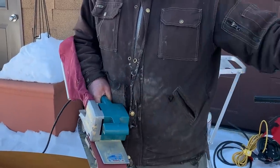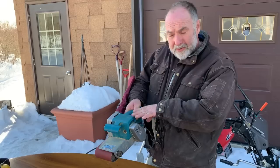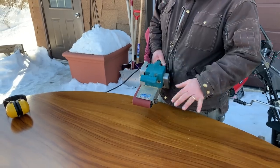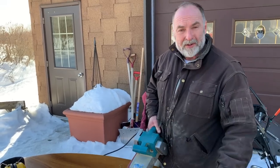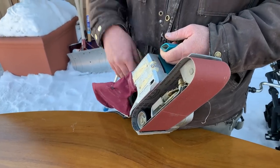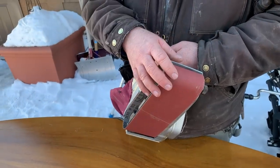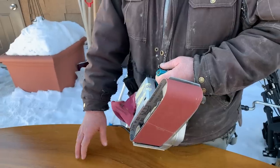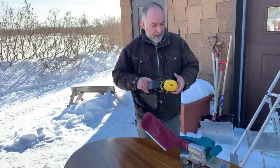I'm going to start with a belt sander with the grain. If this was a tabletop I was making from scratch with some mismatch between pieces — one higher or lower than the other — I'd probably start sanding cross-grain, because it leaves scratches but removes wood very quickly, and then finish up with parallel-grain sanding. But I'll go right to parallel grain now. An 80-grit belt is a good starting grit. I'll sand all the old finish off the surface, then do the edges with a random orbit sander, then go over it again with a 120-grit belt, and do some hand sanding with the finishing sander.